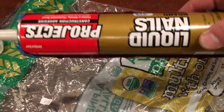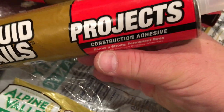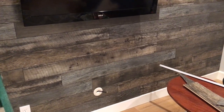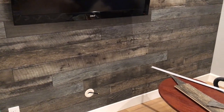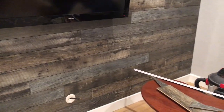Second thing I wish I knew: Liquid Nails Interior Projects — the blue one. It doesn't off-gas very much, it's remarkably strong, and it's about $1.77. On a 120-square-foot wall, I went through probably 15 to 20 tubes. What I wish someone had told me was you really don't need to nail it. This stuff sets up in about 5 to 15 minutes — just get it in position, hold it for a moment, and you're done.